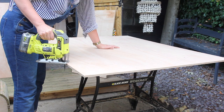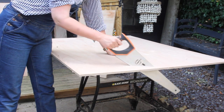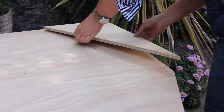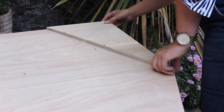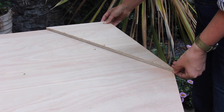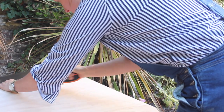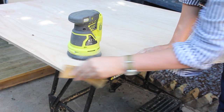On the back panel you're going to draw out the shape of a nice pointy roof. Then cut one of these sides out using your jigsaw. I've done most of my building while the baby was asleep, so I didn't want to wake her up with a power tool, so I used my hand saw instead. Once I cut one side out, I used it as a template to make sure the other side is exactly the same angle — just place it on top and trace a line, then cut the other one out. Please do use your jigsaw for this if you can.